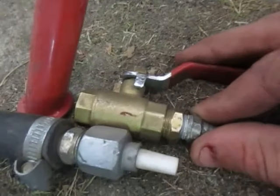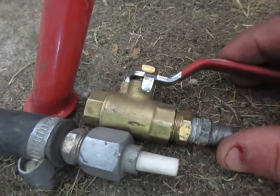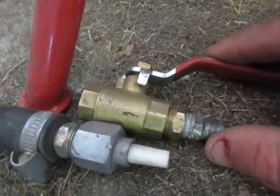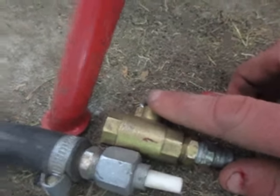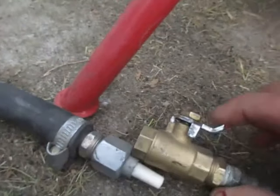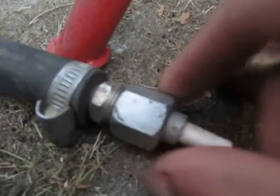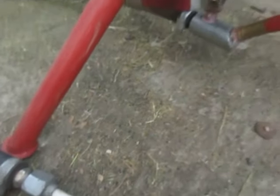The second thing that didn't work well for me was the end of this tip. When it comes from the factory it will have this 3/8 inch lever. It didn't work very well for me, because when I turn this off, this entire hose has a tendency to fill with sand — and then I'm frustrated. So what I did was change my technique: I got rid of the lever, and the ceramic tip here I just put straight on — it's the same threading, not a big deal. Save the lever though, because we're going to talk about it last. This is the only real change to the device.